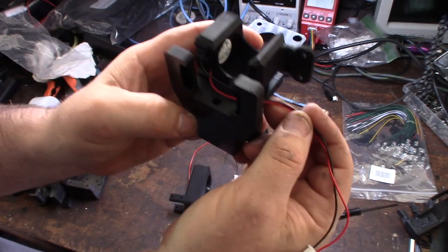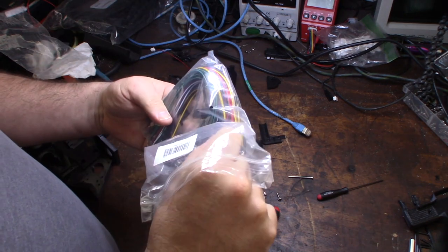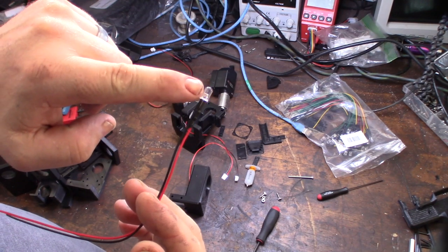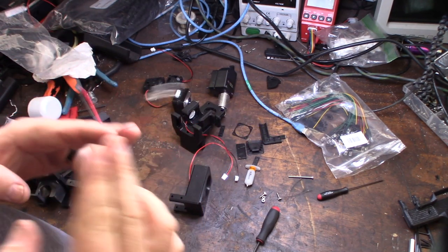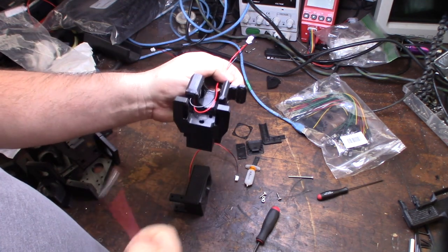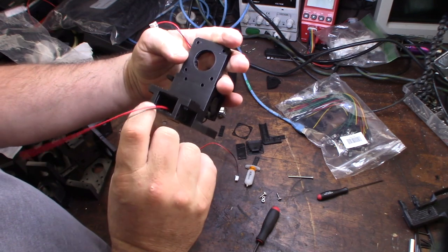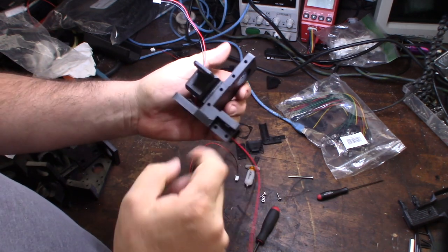There's a hole for an LED — I'm going to use one of these 5mm LEDs. Make sure you get 12-volt compatible ones; most LEDs are 3.3V but these have a resistor under the shrink wrap so you can feed them 12V. I always love having LEDs so when I'm logged into OctoPrint I can look remotely — the wire fishes back through there and through the wire management.